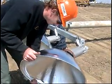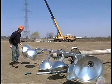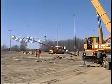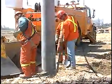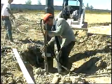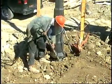Poles are usually dressed on the ground before being lifted into position. While the basic technique is similar to other pole installation, it must be remembered that the equipment installed at the top of the pole can weigh up to 4,000 pounds. When lifting, the sling must be moved up the pole to compensate. As with the distribution poles, tamping the backfill every 4 inches is essential. When StressCrete's Americana poles are installed, tamping is carried out in the normal way until the flared base intrudes. At that point, vertical tamping is no longer practical, and backfill is consolidated by tamping against the pole's burial section until completed.